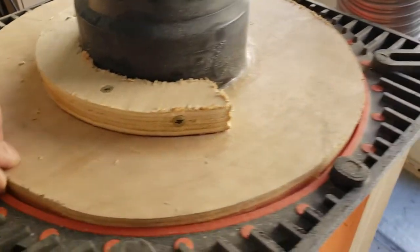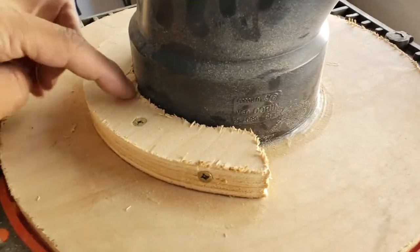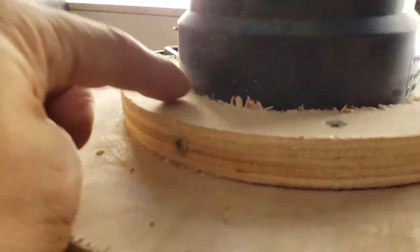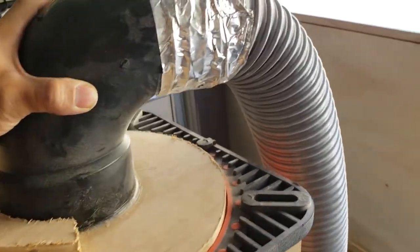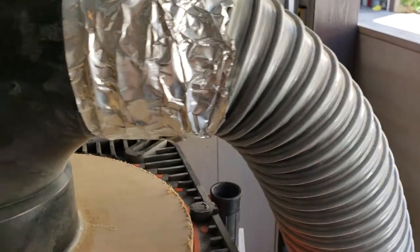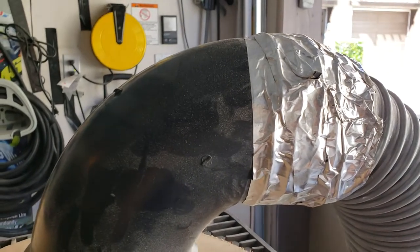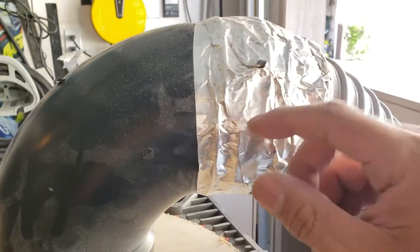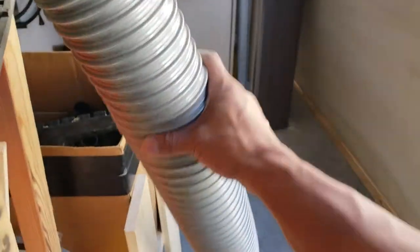At the top I rounded out some plywood to fit inside the cone to cap it, since the cone is hollow inside. A screw through a stabilizing piece goes into the output pipe to keep it stable. For the connection between PVC and four-inch dust collector hose, the hose is smaller than the outside diameter of the PVC. I know Rockler makes adapters now, but at the time I ghetto-spliced the hose, wrapped it around, and covered it with aluminum ducting tape. It works, though the Harbor Freight hose is pretty rigid.